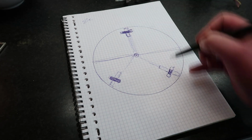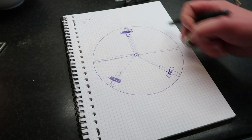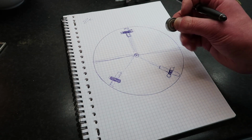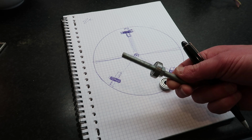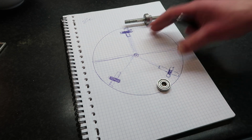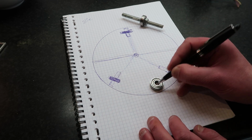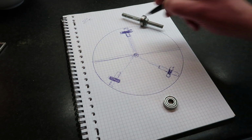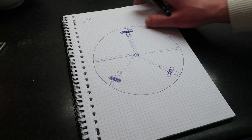then I add another slab that only gives room for the bearing sticking out, because this material is going to be 8.5 millimeters or 8.7. A piece of wood I have left over, so that's why I chose it. And the size is convenient because this is 8, so I can cut all the way through. Then add this piece on another piece, and then I only have to make sure that the bearing is not riding against that piece. So I will make some tiny slots in there, and I think that's a better way than using the marbles.